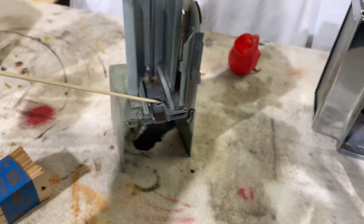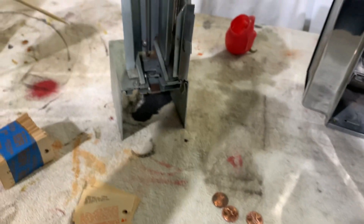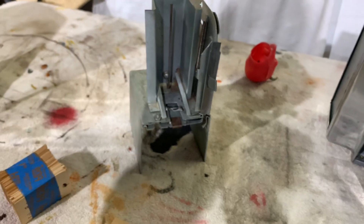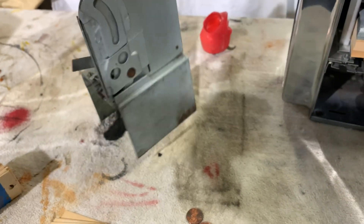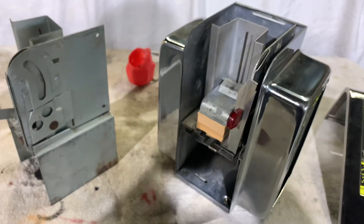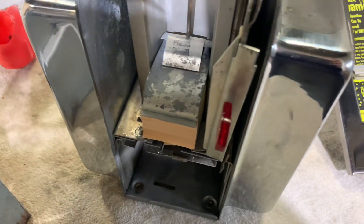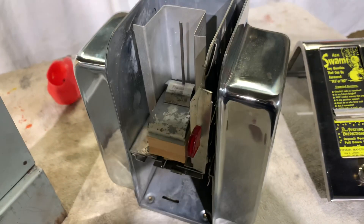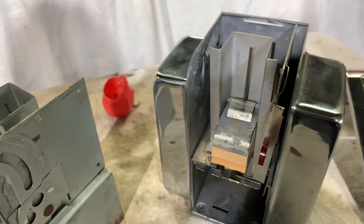You've got your rubber band shoe that has to be on and fresh — it has to be a nice clean rubber band. Over time it gets a little dirty; go back inside the machine, clean it off, make sure the residue is off so it'll be sticky again and push out the fortune. Use wheat pennies if you have them. We had this one come in — Megan's machine. This one is left original, but on Megan's side I actually widened it a little bit so we can get a regular penny in there. It didn't solve the problem 100%, but it definitely made the penny slide down more easily.